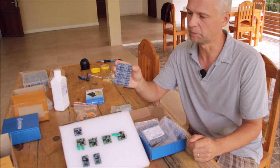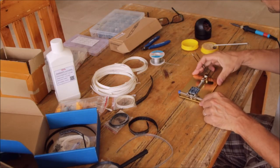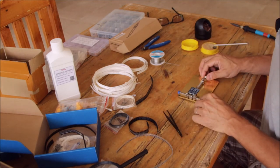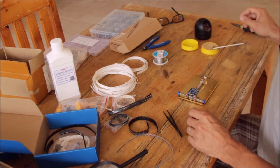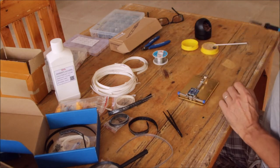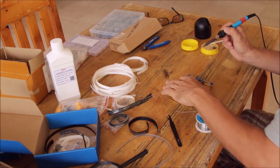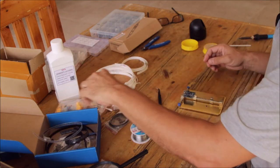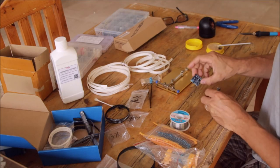What we are going to do now is take these new PCBs and quickly build one of the watchdog timers, then test it. This time I also switched from 0603 sized components to 0805, which makes DIY soldering of SMD components much easier. Starting with the ICs — these are the double MOSFET ICs, one is an N-P channel and the other is a double N-channel combination. Once you get used to it, it's actually nice to work with SMD as long as the components are not too small. Now I'll put the small components — the diode and the resistors.